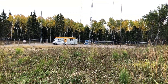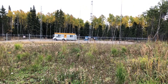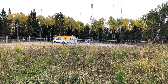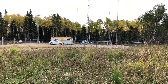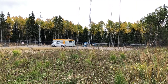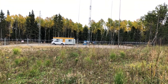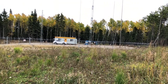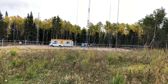That's the system — pretty simple. Having used this now for two years, I always receive on 160 meters with this array in diversity in one ear, and I have the beverages in the other ear. My experience has been that most of the time this array is equal to my beverages, at least as well as one can determine. On occasions when signals are very weak — say, weak Europe or Oceania just bubbling barely at the noise — at those times I might be hearing better in my right ear, especially if I'm using one of the phased broadside beverage pairs, which would make sense since they might have 2 dB or so of RDF improvement over this. That's why only when signals are very, very weak would I notice any slight difference. They're a great array — I'd highly recommend them.